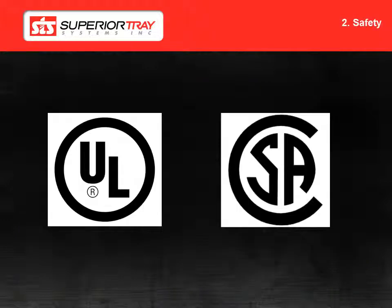The next section is Safety. Our systems have been rigorously tested to comply with UL and CSA standards. In order to achieve the highest level of system safety, it is important to thoroughly understand and follow these installation instructions. These systems should only be serviced by trained professionals. Before any service or installation work is done, ensure that the system is safely disconnected from the power source and that any capacitive loads have been discharged. Check the cables with an inductive ammeter before service. Conduct tests according to the system specifications before re-energizing the system. The ground cable is essential to avoid risk of death and equipment damage. It is highly recommended to drill the ground clamp holes and install the ground cables and bonding clamps prior to pulling the cables to avoid damage to the conductors.